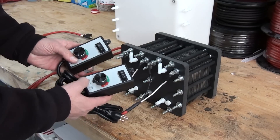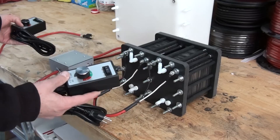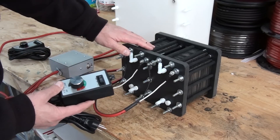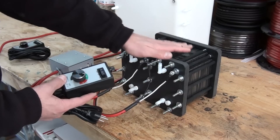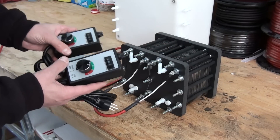You've got a separate controller that controls each side. The generator has two 59-plate stacks. They're independent of each other, so you can control each stack with its corresponding controller.